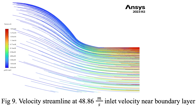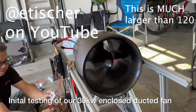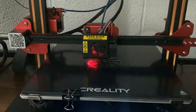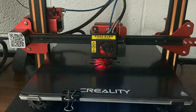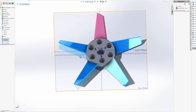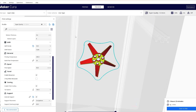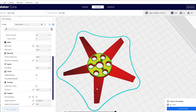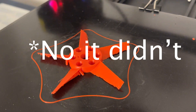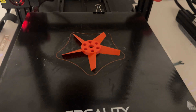I kind of put that project on the back burner until I was playing around with a 120 millimeter EDF at work and realized I could 3D print this a lot easier. FDM is great for printing pretty much anything on the ducted fan except the fan blades themselves, and scaling the entire thing up meant I could print the larger fan blade a lot more easily. So I took the old design, scaled it up, made a very simple 5-bladed fan with a basic airfoil profile and a rectangular extrusion, and just tried it out. The fan blade did need supports to print, but after a couple tries it printed extremely cleanly using pretty minimal tree supports.